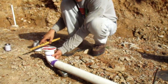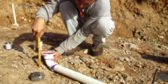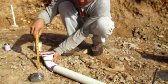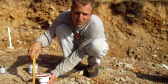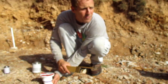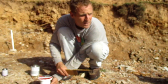We've already done a little bit of pre-measurement, and we're looking for 5 inches. So if I take this out, the height of our drain is going to be exactly 5 inches, exactly what we want, because our concrete slab is going to be 5 inches thick. This is going to work out perfect. Then all we're going to do is make sure that the bubble on our level is leaning towards one side, because we've got about a 5-inch slope from here all the way to the end. So we're going to set that all up and get our pipe run today.